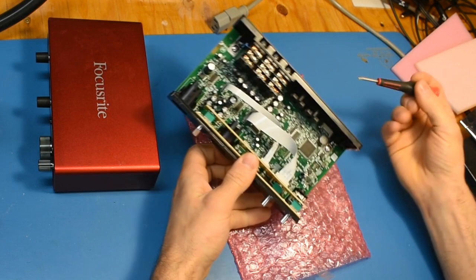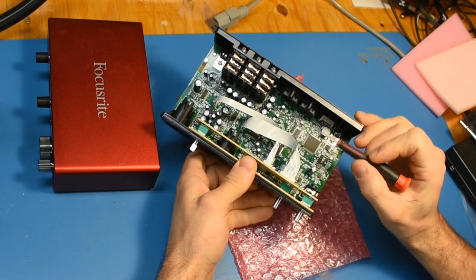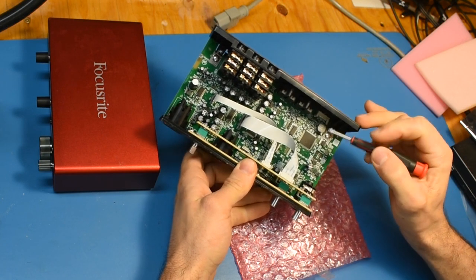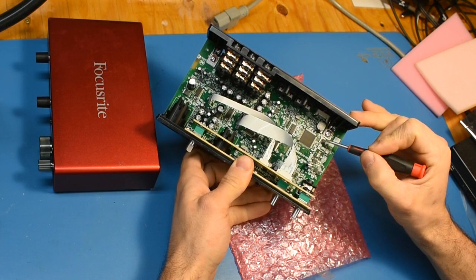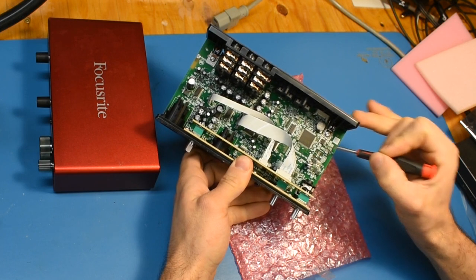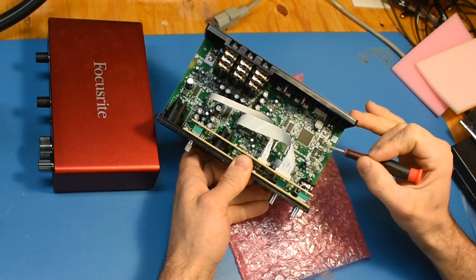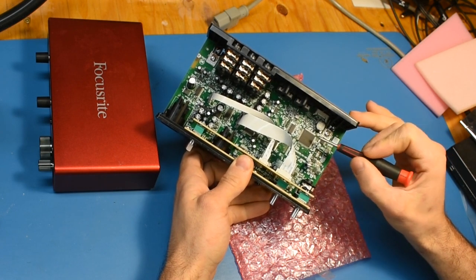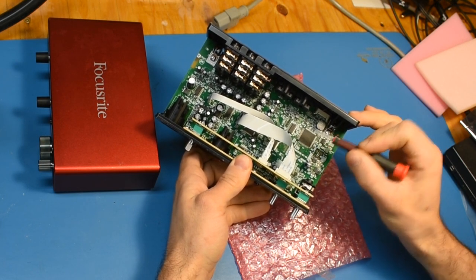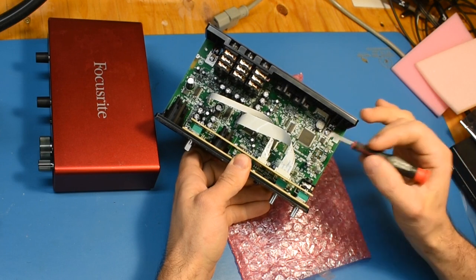As a quick overview: there's a USB connector here, a main processor, and a 1 volt regulator right here — that one usually is not a problem, it only powers the processor. This here is the EEPROM, fed from the 3 volt rail. The 3 volt rail powers part of the CPU, in particular the USB peripheral, maybe some other things — some I/O perhaps. So the USB is usually the first thing to stop working.